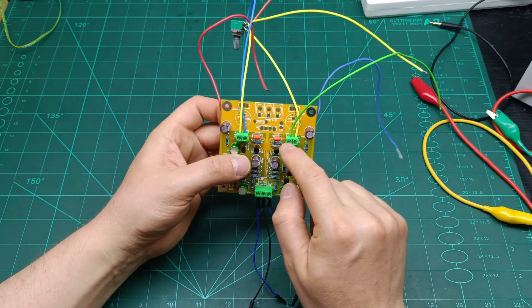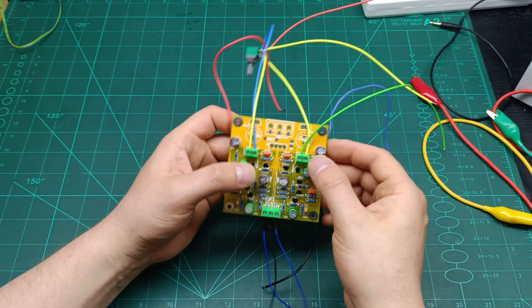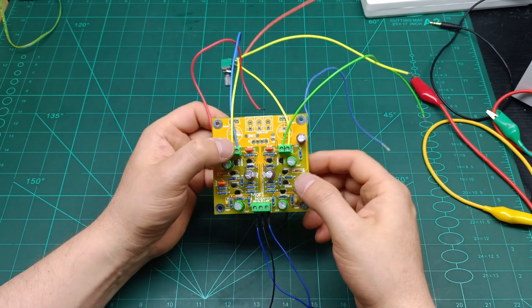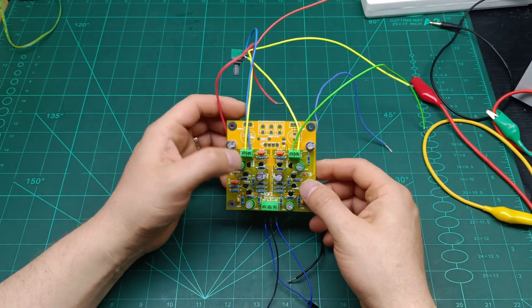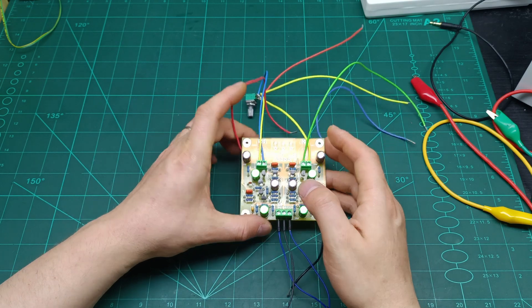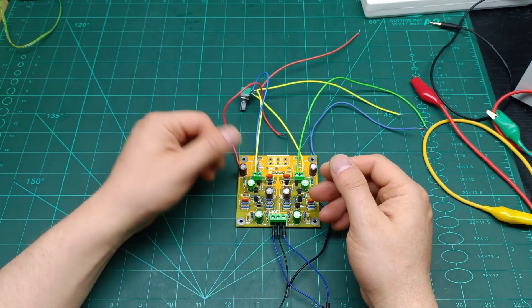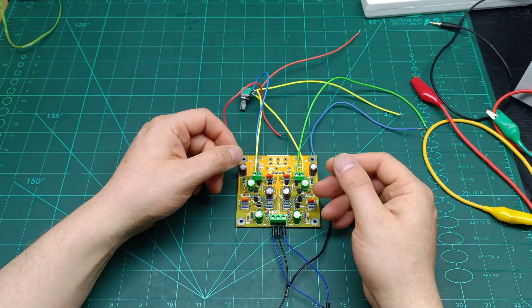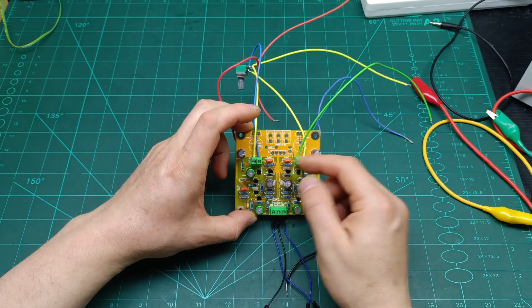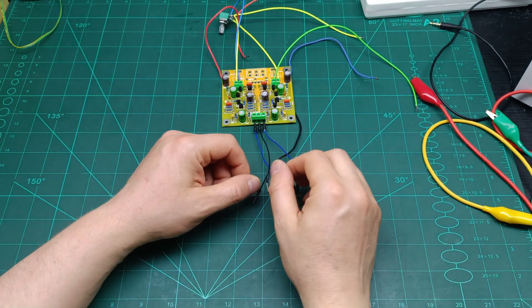One thing to note is the layout — the output is here and the capacitors are there, making it really hard to connect wires. I may do the power supply separately and enclose it — isolated with aluminium around it — to avoid any noise from the transformer, and bring just the DC voltage straight to the pre-amplifier. Stay tuned, please subscribe and activate the notification bell.